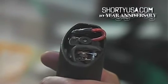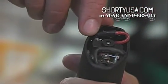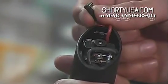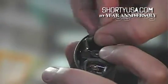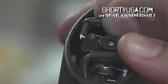As you can see inside the pistol grip, there are two wires. We can see right here that the positive wire is disconnected from the motor. It's a simple fix — it's a blade connector. Just slide it back down onto the motor terminal. Make sure it's on good and tight so it doesn't pop back off.